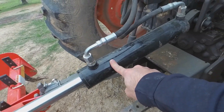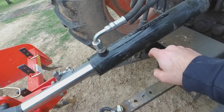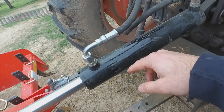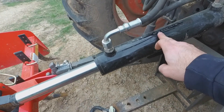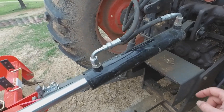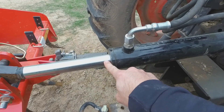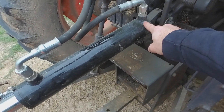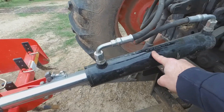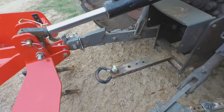This particular top link is a Magister — I think that's how you pronounce it. I bought it off Amazon; they also have their own website. I'll throw some links down in the description. I've had good luck with it; I've had this on here for a couple of years. Depending on what I'm doing, sometimes I'll take this off and put my regular rigid top link on that came with the tractor, like for my hay mower. This one is a two-and-a-half inch bore, sized for cat 2, with one-inch pin swivel eyes, so it does work with a cat 2 top link.